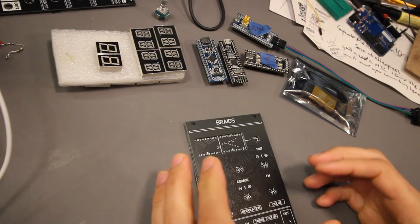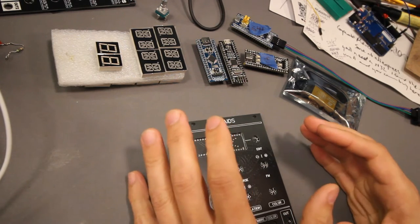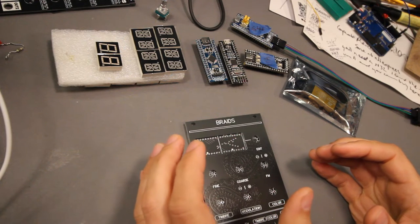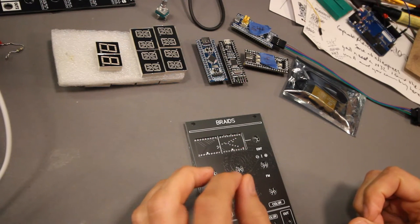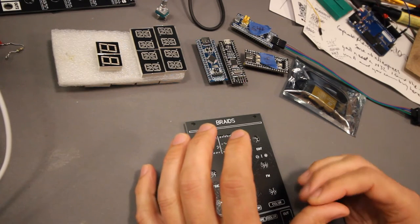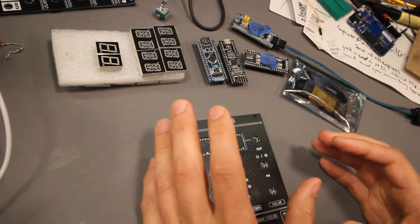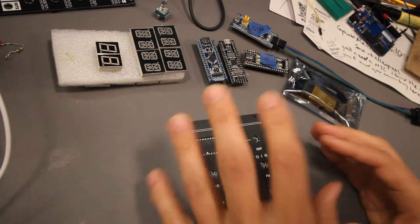All right, let's look at some of the more special hardware we need to find. The bill of materials is quite straightforward. There are quite a few not special parts, but expensive parts, like the MCP3204 quad 12-bit ADC and the MCP4822 12-bit DAC, and a lot of power regulators and stuff like that. But in most large component distributors, you will find these parts no problem. The bit special parts are on this table. Some difficult to find, some not.